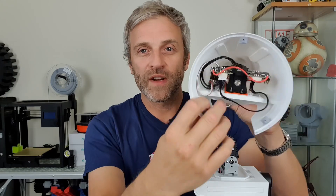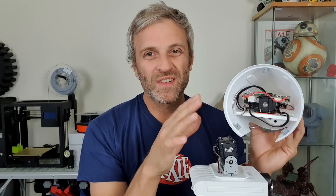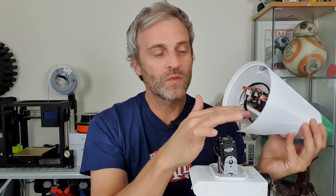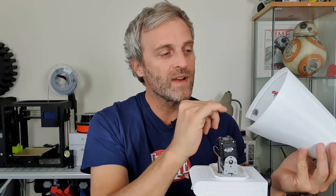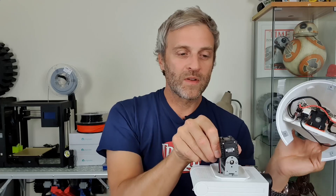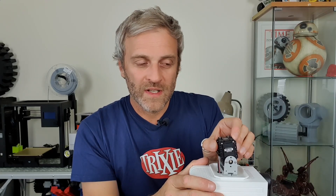One other thing I tried was mounting the servo on a little rubber shim which was 3D printed in Ninjaflex. I'm not sure how much difference that really made - if I'm really going to go to town on noise dampening I could pack some foam around it, and really the rubber shim should be neoprene or something more compressible. But the most important thing is it's got rid of the mechanical slop in the servos, so the head immediately became more rigid.